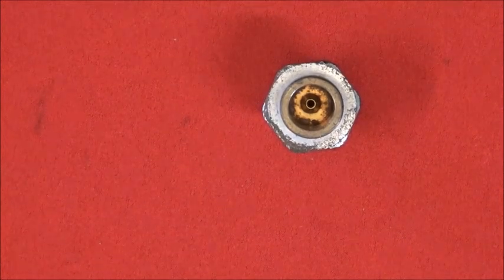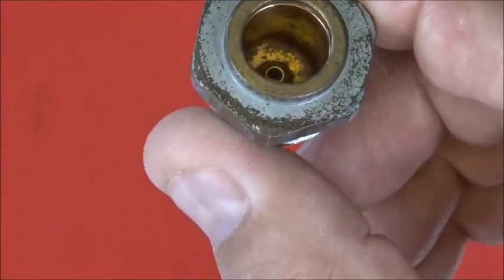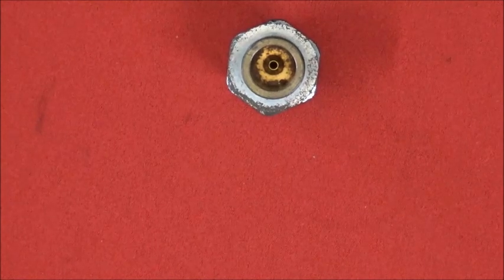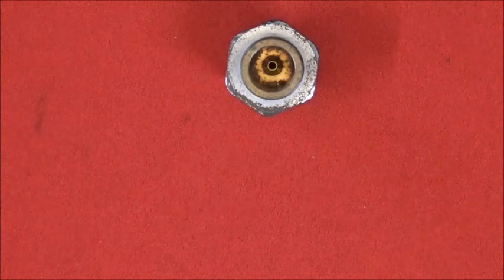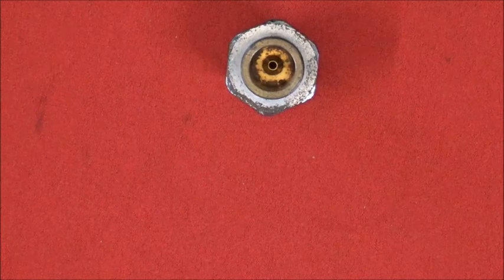The key thing to look at is the volcano orifice in the center — it's volcano shaped. Over the years, through use, abuse, and various folks trying to repair them, a lot of times they got distorted, or they got nicks, gouges, and problems with them, and the high pressure seat would no longer seal to it.